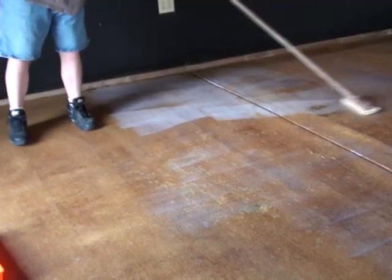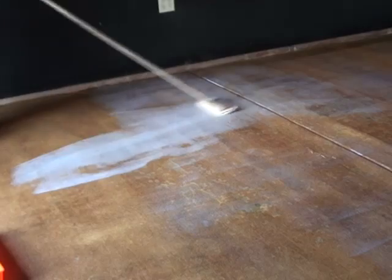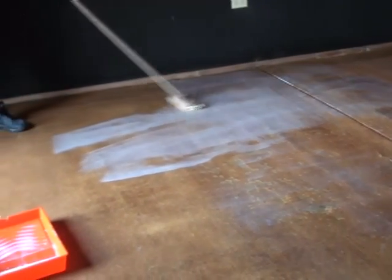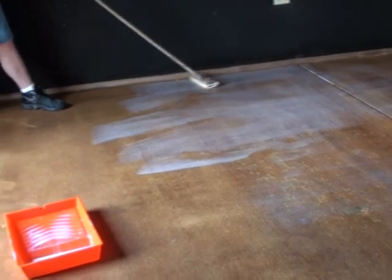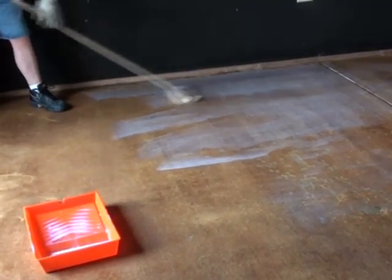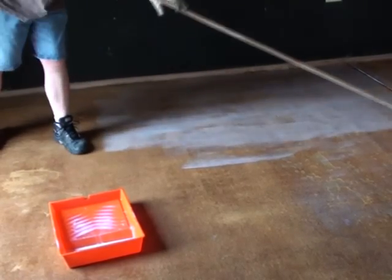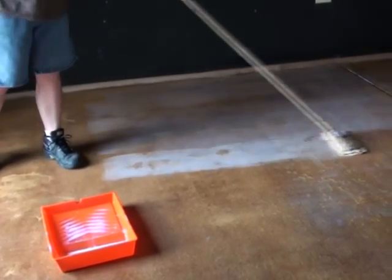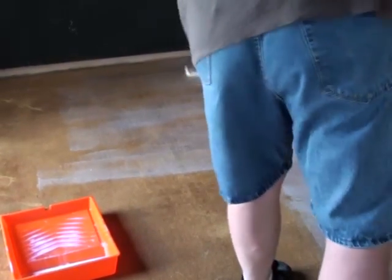Standing water for an extended period of time on wax can cause the wax to go cloudy or blue, but usually a good mop-on wax, once it is dried, will dry back down clear. Most mop-on waxes are UV resistant, but they will not hold up to chemicals such as gas, oil drips, paint thinners, or heavy cleaners like ammonia.